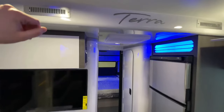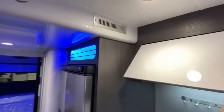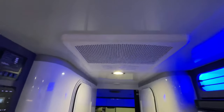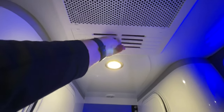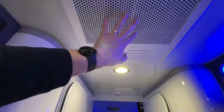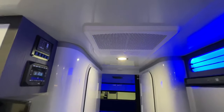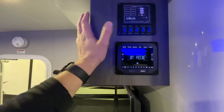Single AC unit on this one. You've got aluminum ducting that goes through, and you've got two of these vents on the other side of your bedroom as well. That AC unit itself does have a direct drop to it — slide it open and it'll dump air straight down. Cold air return is going to be right here. This can pop off and will pop off when you need to clean your filter — rinse that bad boy off, let it dry off, and pop it back in.